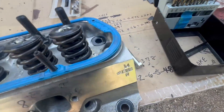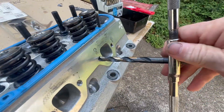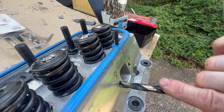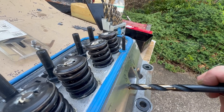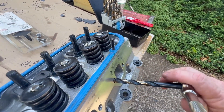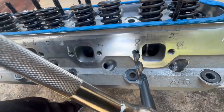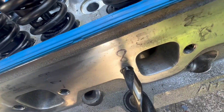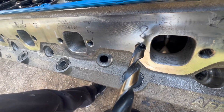I'm going to at least hand-start this. I might switch over to the drill depending on how it goes. I left my tripod down at the car shop, so I'm having to hand-hold the camera, and it is not working out all that well. I might have to do this off-camera and come back. Since it's just going a short depth, it is so easy to get off track with a power drill — I just want to do this by hand and let it find its way in. Since it's aluminum, if it was steel it would be a different story.